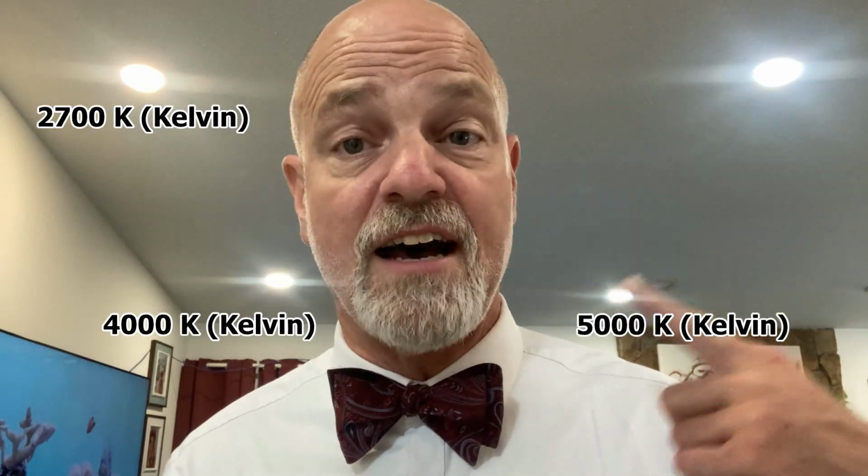Now, I think it's very interesting because these lights mean different things to different people. First off, this light right here, this is the color that we are used to. Now, we are white balanced on the 4000 Kelvin right here. In fact, I'm gonna throw up some labels here that I'm gonna leave a while that shows exactly which one of these is tuned to what. So this one up here is 2700 Kelvin. I don't have a 3000 Kelvin, but you'll notice a lot of lights come at 3000 Kelvin. They're trying to approximate the old incandescent lights. This one here is 4000 Kelvin. This one here is 5000 Kelvin.